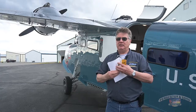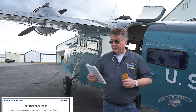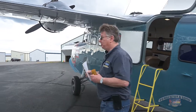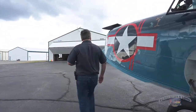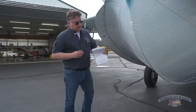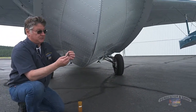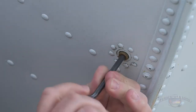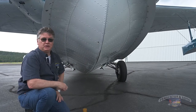We've got a pretty detailed pre-flight inspection procedure we go through, and we're pretty religious about this. It's a complicated airplane and a lot of things need to be looked at carefully. The first item is to check all the hull plugs. Most of the hull plugs are along the keel strip, the first of which is up in the nose. We always install the plugs with the Allen wrench on its long axis so you don't over-tighten.